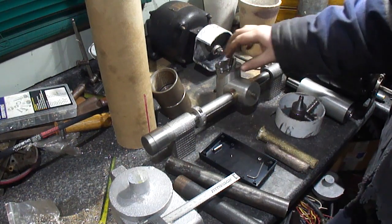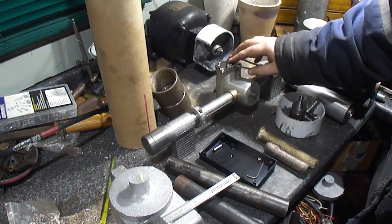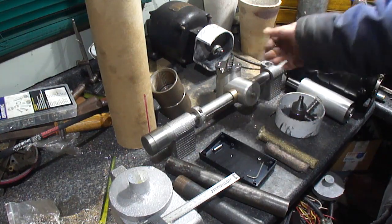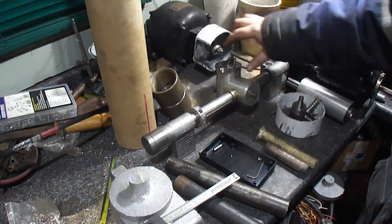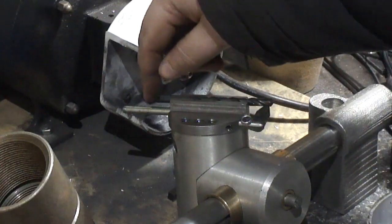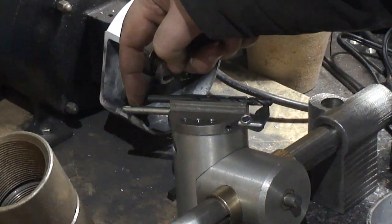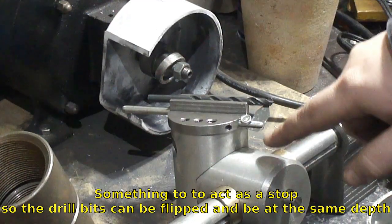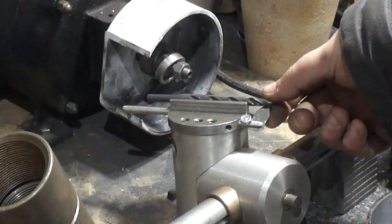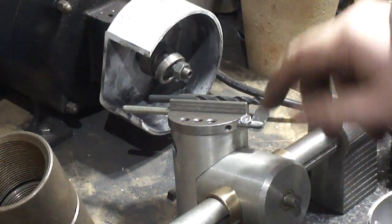drill bits. I gotta back it out a little bit though. You have the backstop here so you can flip it. And I wanted to do it this way. Hopefully you can see it. I had the hole here for a backstop. It'll just have a clamping block, probably a piece of aluminum. It just clamps on it. This side holds a piece of hacksaw blade for indicating for a finger for sharpening drill bits and stuff like that. It'll lock in place.